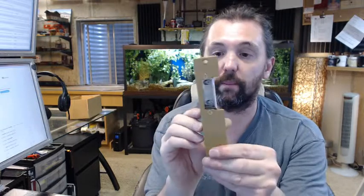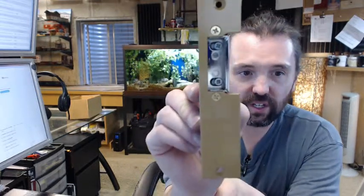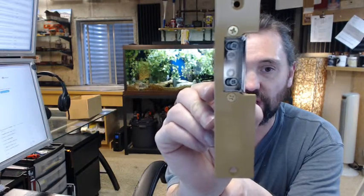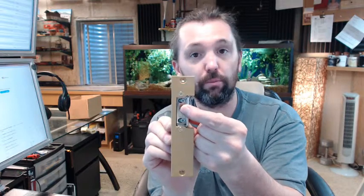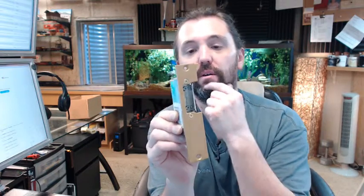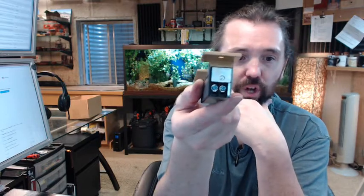If the electrical properties coming into them are good, they do last — they are really good. What I like about this model is that you can adjust the keeper a little bit with those two screws and the slotted holes you can see, to help tailor to the point where you are getting proper latching but not a preload condition on the strike. If it is too tight and the latch pushes the keeper like this, that is called preload and it will interfere with the strike's ability to do its job.